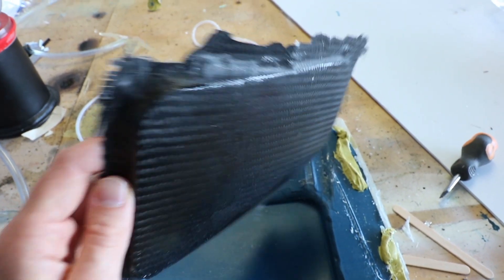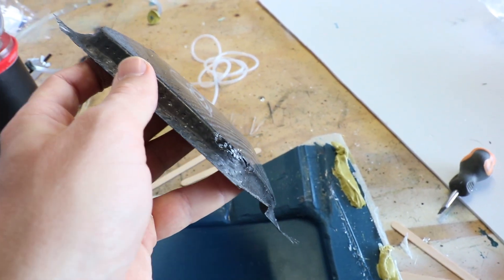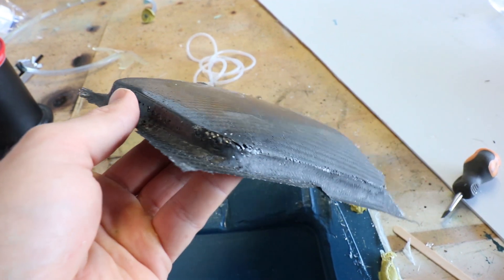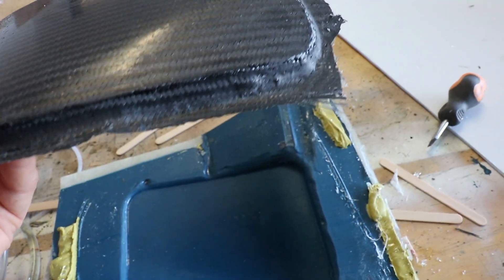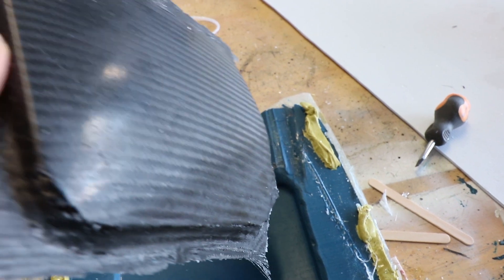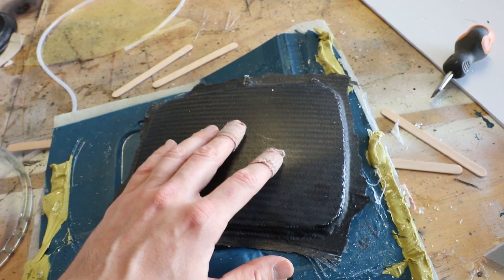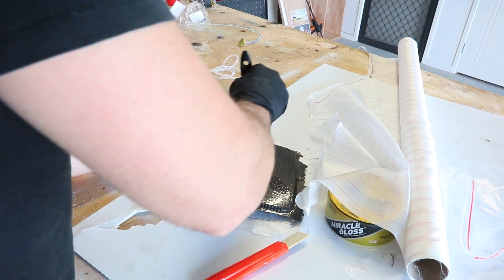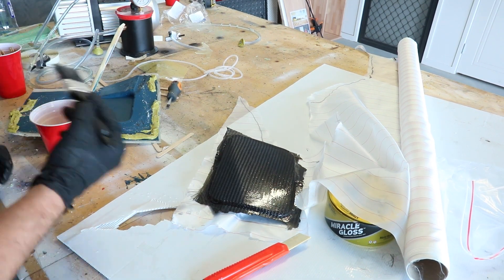The part has come out a lot better than the last one but still far from perfect. The big issues are areas where it looks like the resin has delaminated off the carbon fiber and stayed stuck inside the mold. Other than that it's not too bad — a few pinholes all over it. So what I'm going to do is mix up some resin, paint it over the top and then sand it back. Ideally with resin infusion molding you shouldn't have to do this at all, but since my parts still aren't coming out perfectly, I'm going to have to.